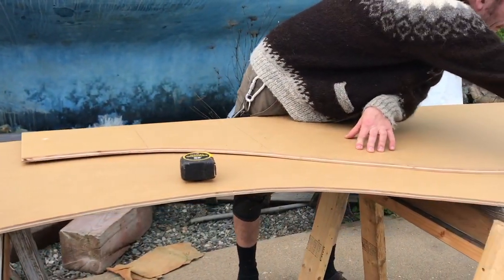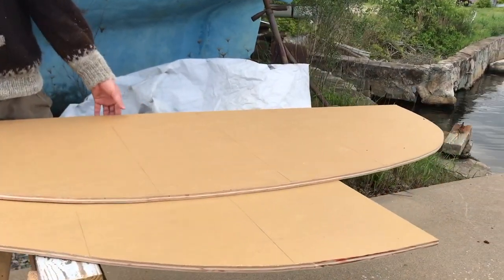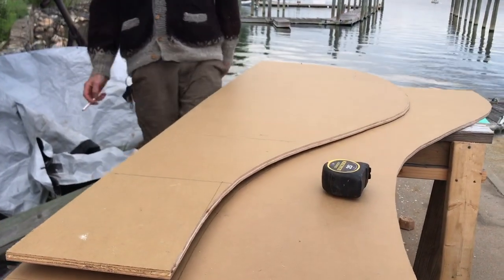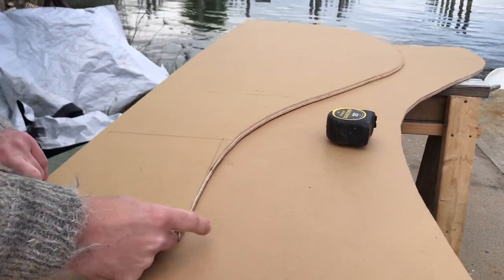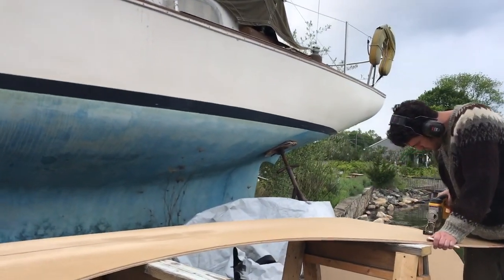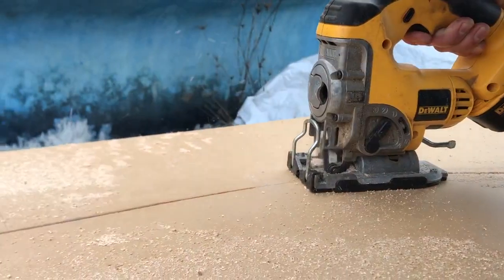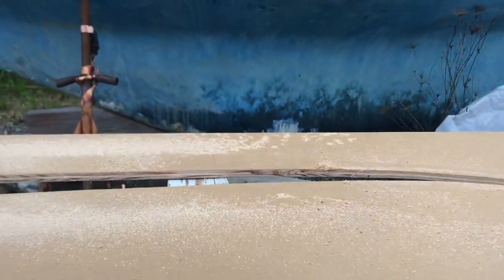What I'm planning to do is to laminate this rudder out of many pieces of plywood, and there's a number of reasons for that. One is that a rudder is a notoriously difficult thing to keep happy, because half of it's in the water and half of it isn't, which for solid wood construction can be an issue over time. Not straight away, but over time that becomes an issue. Laminating with plywood and fiberglass is incredibly strong